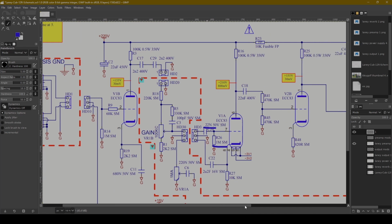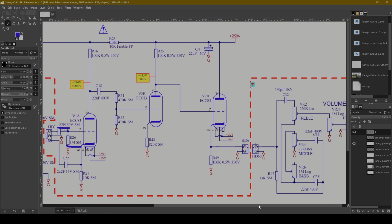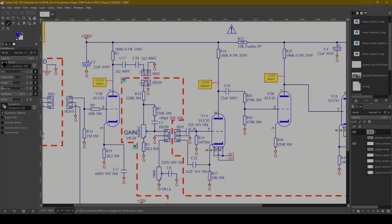let's look over here at our tone stack. Yeah, it'd be like a treble control. So I think you are getting a little bit of very high frequency being shunted to ground here. So you've got a little bit of bass cut here, a little bit of treble boost here, a little bit of treble cut here. So some subtle choices are being made to tweak the tone a little bit.